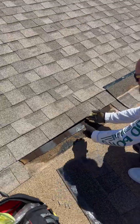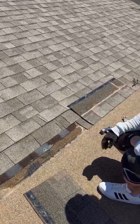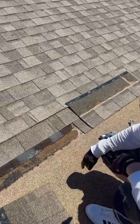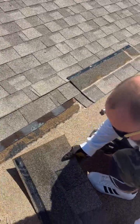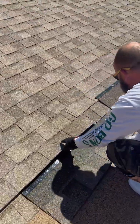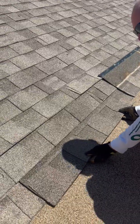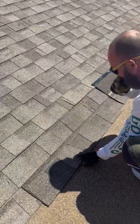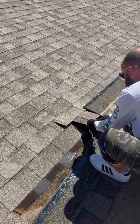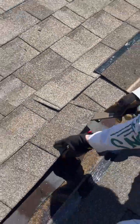We had to pull the nails on the first row over here, and we're going to have to get those back in, which means replacing these two shingles. Let's get this guy under there — it is running into the fasteners up here, so we're going to have to find those and get those out in order to get the shingle all the way in.